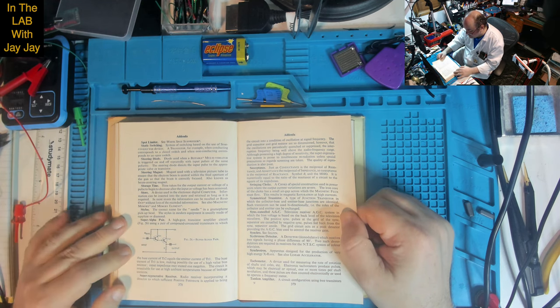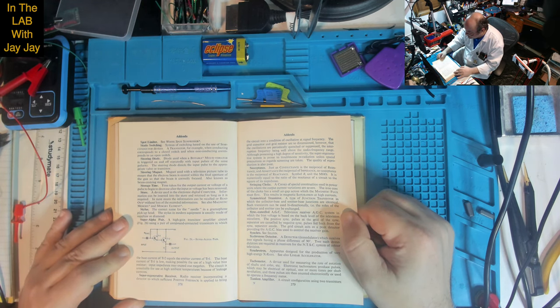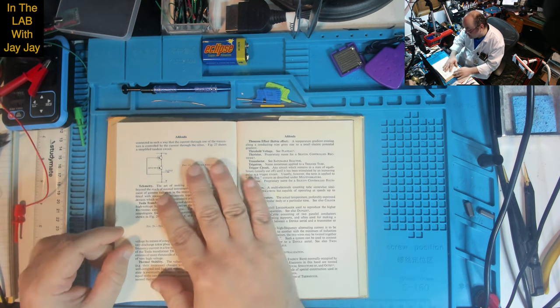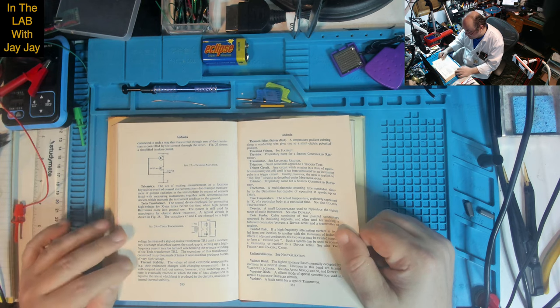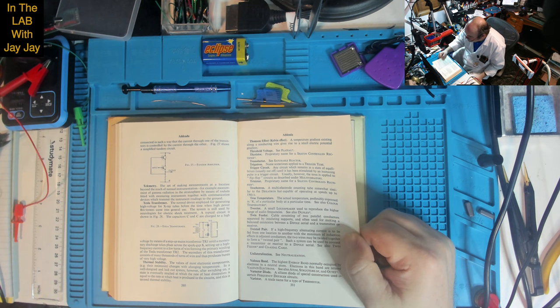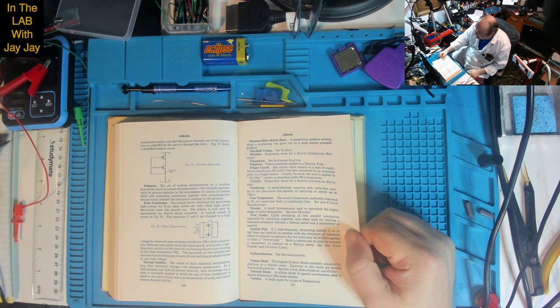Stylus, super alpha pair, super regenerative receiver, susceptance, swinging choke, symmetrical transistor, sync cancelled, synchro, synchronous detector, synchrotron, tachometer, a device for measuring the rate of rotation. Tandem amplifier, telemetry, Tesla transformer, thermal stability, Thomson effect, Kelvin effect, threshold voltage, thyristor, transducer, trigatron, trigger circuit, any circuit which remains in a state of equilibrium, usually cut off, until it has been stimulated by an incoming pulse, is a trigger circuit. Usually, however, the term is applied to flip-flop circuits as described under multivibrators.